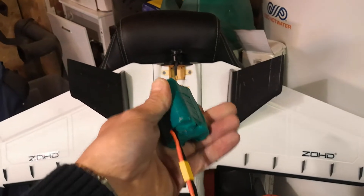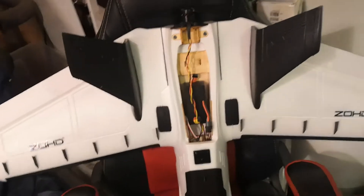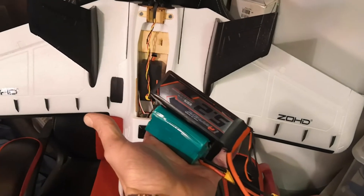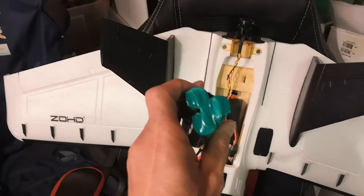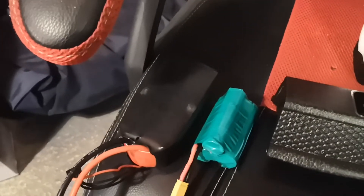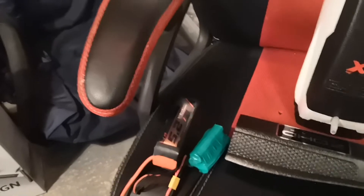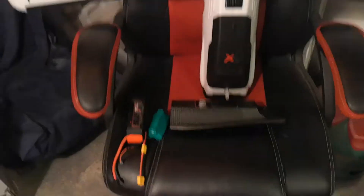There is also the option of using this pack that I'd made up for the Dart 250G - I'm planning on running that on 3S lithium ion. With the lighter weight of this pack, it's about half the weight of the 3S LiPo 5200, and these are supposedly 3,500 milliamp hours each, giving a total of 10,500 milliamp hours. I think they're probably closer to 2,500, but even then, for half the weight you're still getting about 50% extra capacity for a much smaller size than you would with a LiPo. LiPos are great when you need high power output, but this is more about efficiency and long range, and we've got this incredibly efficient Parrot Disco motor on there. So the lithium ion might be the way to go. When I test it first, I'm probably just going to use the OEM Disco battery and see how we get on.